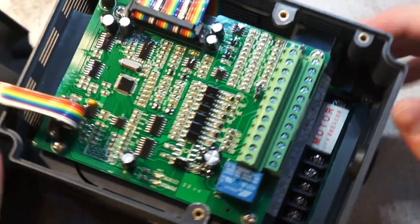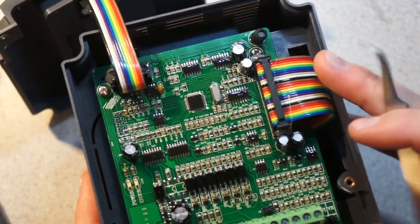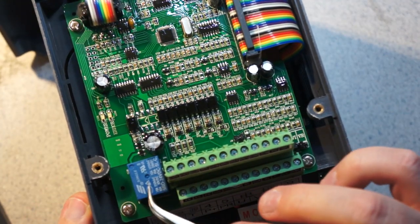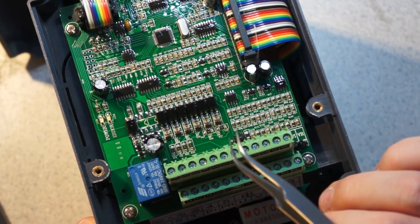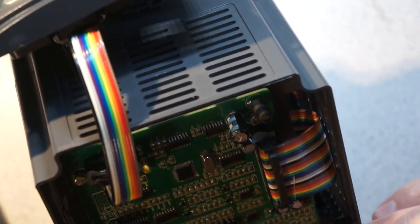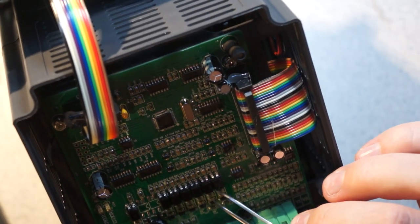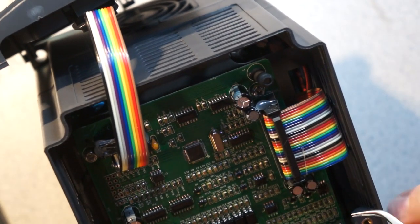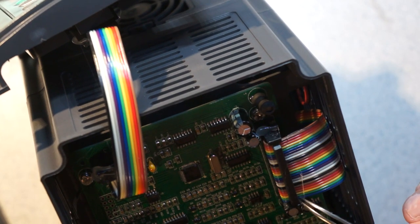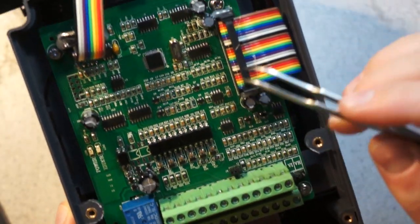It's possible that. Okay. So, first thing I notice, conformally coated. That's nice. Second thing I notice, hello, opto interrupters and a relay. So I believe this is like an external contact closure for basically system stuff, so you can have this turn something else on when it comes up to power or something like that. We have a bunch of opto isolators. These would, I would assume, be drivers for them. I'm not sure how they're managing all of these IO lines off so few pins. Board is quite heavily conformally coated.